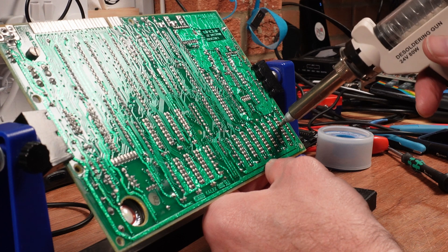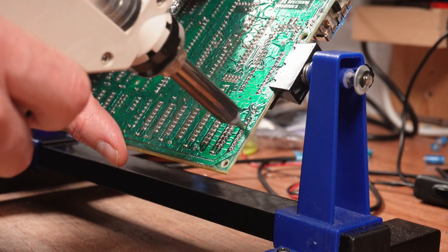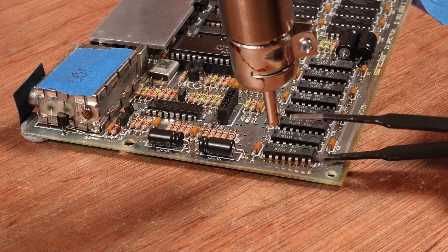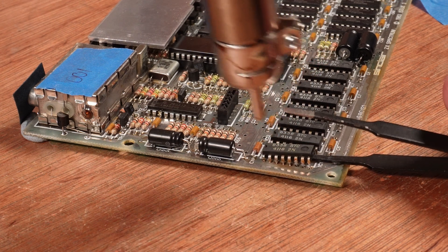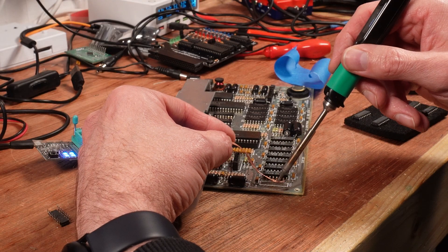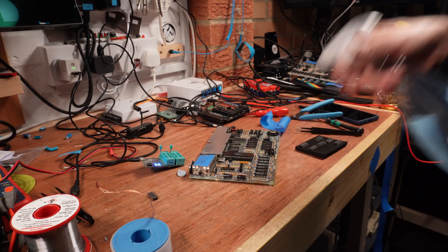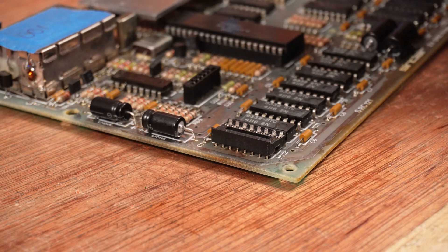My current safest method is to remove as much solder as possible from the bottom side with the desoldering gun. If the chip doesn't fall out at this point, a better method than manual force is to use some hot air to loosen the last bits of solder on the top side and gently pry the chip out. This still carries risk - it's all too easy to rush this. You're aware you might be putting too much heat into the board, but it's important to be patient, gently nudging at the chip to check when it's properly free and only then remove it. No damage. While the chip is out it's a good idea to clean any stray solder from the top side with solder wick - but be very careful, as dragging hot wick over these bare traces can easily lift them. Once the excess solder is carefully removed and cleaned up with IPA, visually inspect for damage or bridges, then install a new socket.